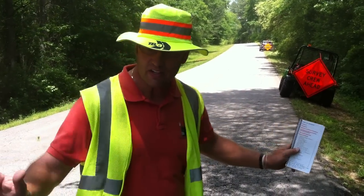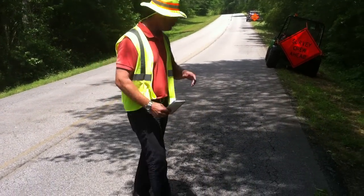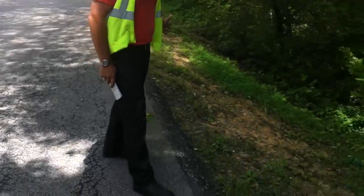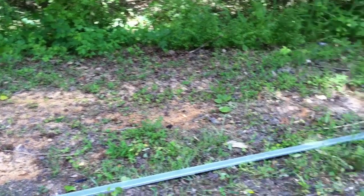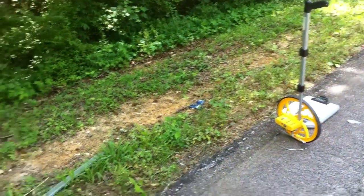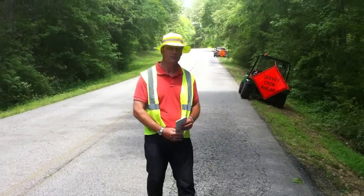Today we don't have enough cold mix — you'd need a dump truck to fix this situation properly. First, we need about five tandem loads of dirt along this shoulder to provide some lateral support. Second, we've got four, six, perhaps eight inches of asphalt thickness in here that's not doing the job. That tells me we've got a sub-base failure problem.